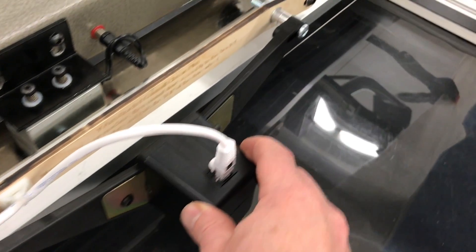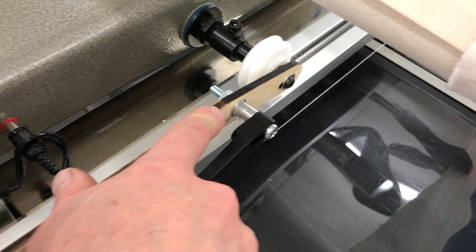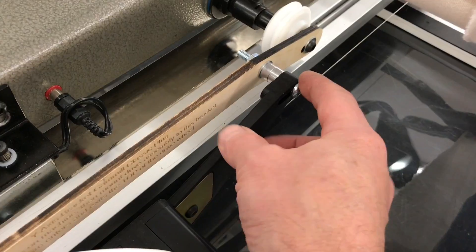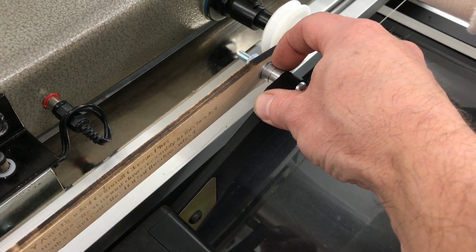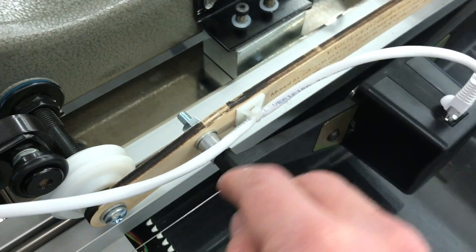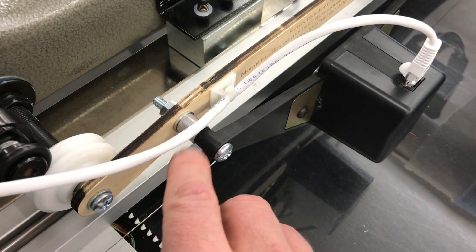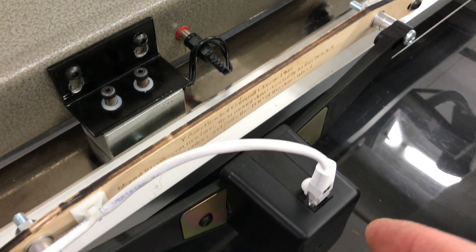Next, take one of the drive assemblies and attach it to the holder piece with two 2.5-inch long screws. Place the screw through the drive assembly, then apply two 1/4-inch spacers and a washer. Then on the back side, another washer and nut. Do the same on the back: a 1/4-20 by 2.5-inch long screw, two spacers, one washer, another washer on this side, and a nut. Once both are installed, tighten those securely.